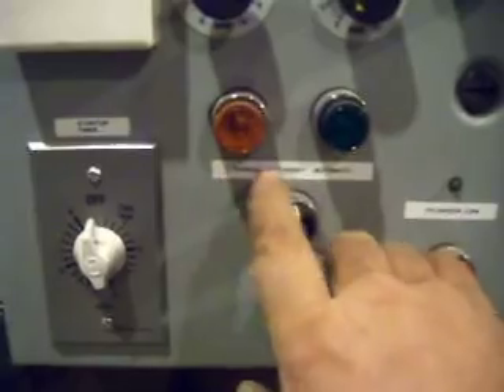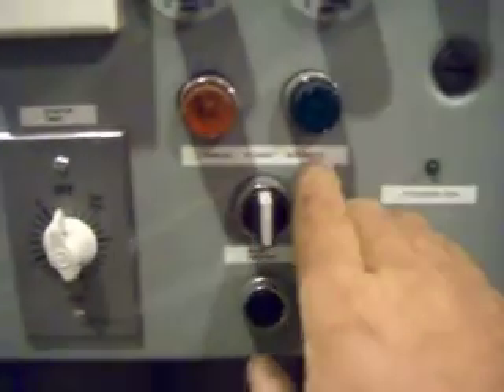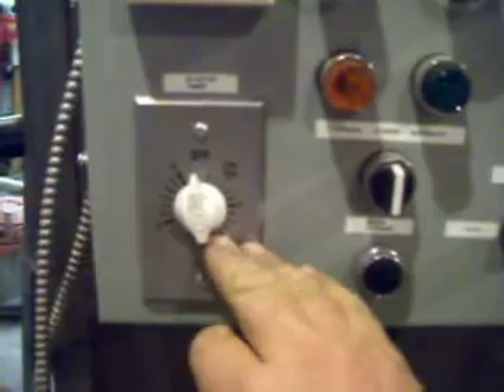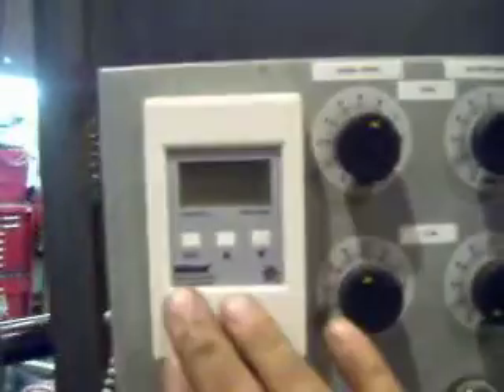There are three different modes: manual, standby, and automatic. The selector switch will select either one. This is an auger override in case the actual hold bin runs empty and you have to feed the auger. This is a startup timer, zero to four hours — it runs until the boiler gets up to temperature. Right now there are just some temporary mimics, stuff that mimics the system. There are a couple of thermostats here that go to this controller, and a couple of switches that mimic high limit and low limit.